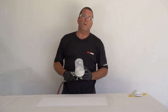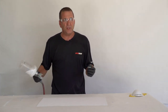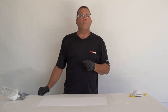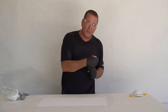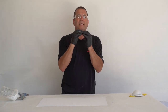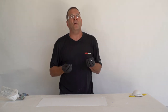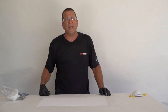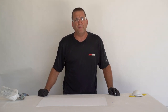You don't have to do it this way. The other option would be to mix the paint for a spray application, put the non-skid in the paint, and spray the non-skid and the paint together. Either way — whether you roll it and spray it on dry, or put the non-skid in the paint and spray it on wet — you always need to follow up with a final coat of just straight paint to encapsulate the non-skid particles. If you don't do that, the non-skid particles will float in the coating, become very absorbent, and be prone to staining. It'll last much longer and look much better if you apply a coat of just straight paint over top of it.